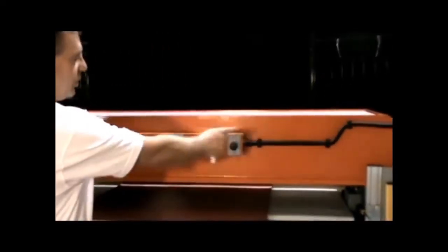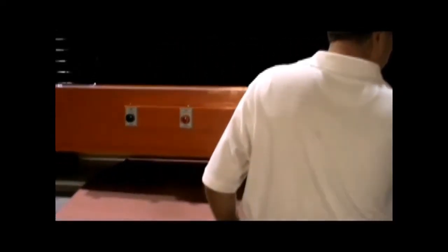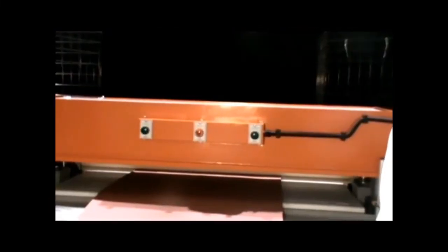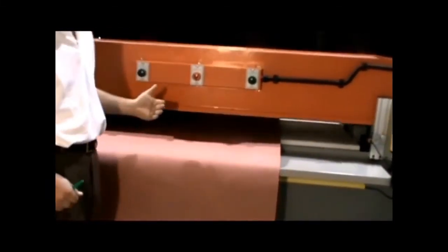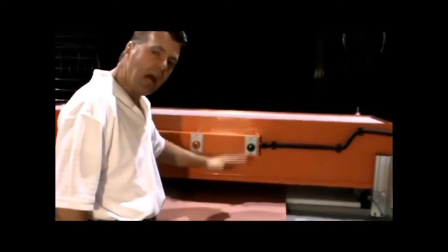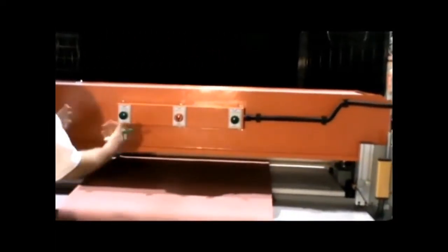There are three different safety switches on here. In manual mode, it requires two hands — that's a safety feature. You can forward your material or take it back again. In manual mode, I can cut single times or switch to fully automatic. I can change the delay, the speed going down, and the height it comes up and down. In automatic, it advances, I pick up my pieces, it advances again, I pick up more pieces. If you really want to make employees happy, just keep incrementally increasing the speed each day by just a little bit — it'll get very fast.